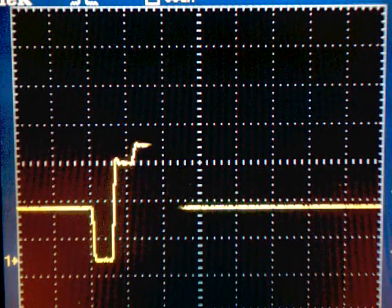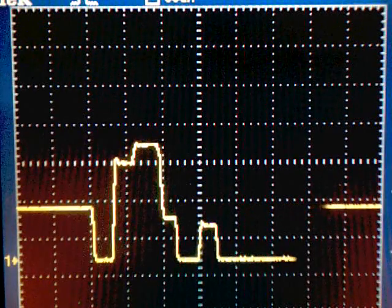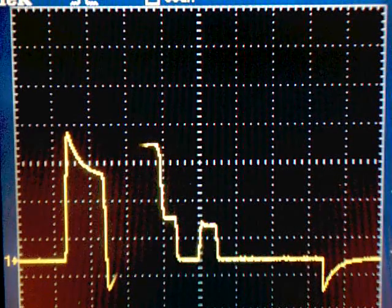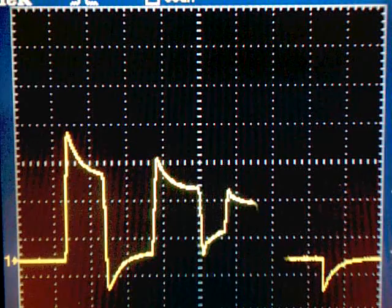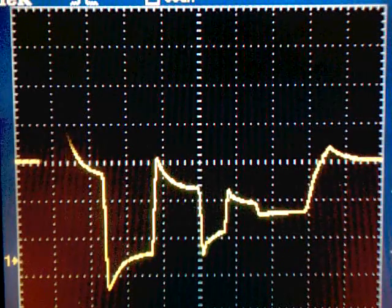Here is proportional only right here as I spin around the potentiometer. And here it is with the derivative function — you can see that extra little kick it's getting there. The faster I turn the potentiometer, the more kick I get. That's derivative control right there.